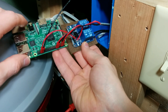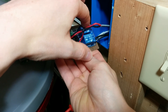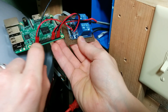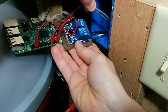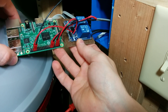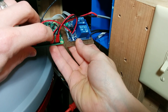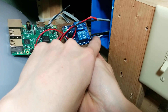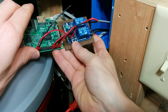There are two components inside of this electrical box: a Raspberry Pi 3 and a relay board. If you're not familiar with a Raspberry Pi, it's basically a small computer with a bank of input and output pins on the side. I'm using the two switches from the tools as inputs. There's a small bit of code on the Raspberry Pi that's looking for switch states every second. Once it reads a switch being pressed, it sends an output signal to the relay. The relay closes, causing the connection to the main power switch to be made, which turns on the dust collector.